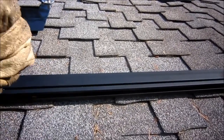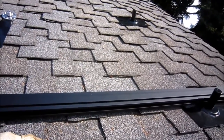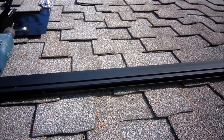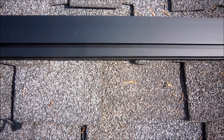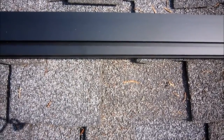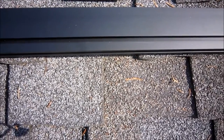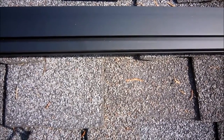You have to bang on the roof — it makes a different sound. That's the spot right in here. Since this rail is already resting on two other mounts, I'll be able to drill my hole right in here. When you drill into the roof, you have to be perpendicular to the surface. Don't go in there crooked, because your standoffs are going to come out in the same orientation as the drill hole. You also don't want to go diagonal left to right, because your lag bolt might pop through the side of your truss, and if it doesn't have enough thread in the truss, it's not going to hold the shear or the pull-out force. It won't be able to do its job.